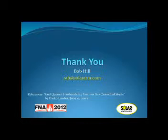There are many other alloys we can look at. If you have any ideas, please see me — here's my email address, and everybody received a copy of my paper today. I'm also citing a paper from 2009 by Dr. Landek, a professor in Croatia, who performed similar work. He built a small vacuum chamber with inductor coils but performed his work only with O2 tool steel — we've been doing O2 for quite a while now, so this takes it another step with pressures and gas velocity. I just wanted to cite that some of this work has been done previously. Thank you very much.